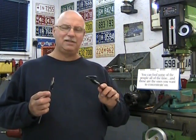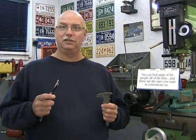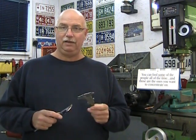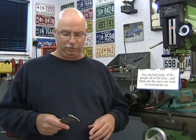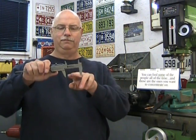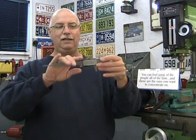Calipers — they really are amazingly versatile measuring tools, but they do have their limitations. Versatility is not one of them. First we have digital or vernier scale, and we can also add dial calipers. But that's just a method of reading — what they can actually do is outside measurements, inside measurements, depth measurements two ways on this end, and from a shoulder on this end here.